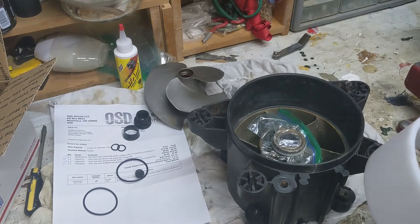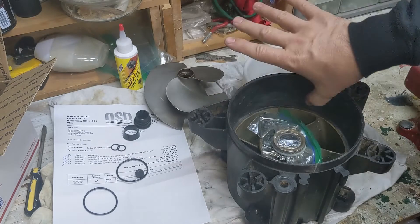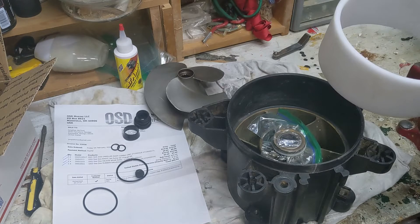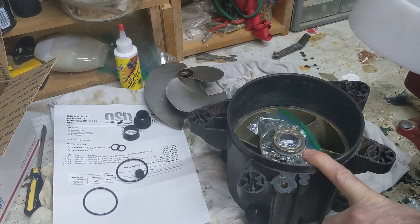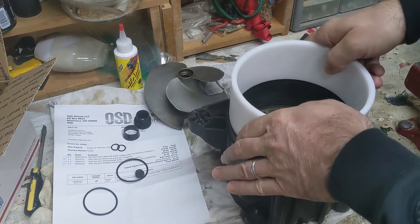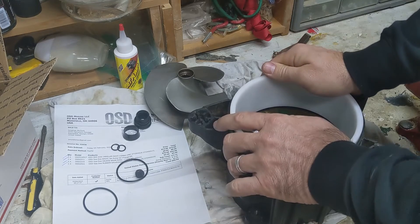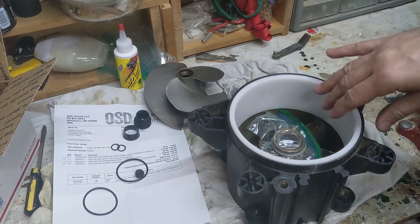Normally, if these fit tight, you want to make sure the inside of your pump housing is pretty clean and free of any chunks or glue. But if your wear ring does fit too tight, what you can do is let this sit out in the sun to warm up and put this in the freezer — this will shrink a little bit and this will expand, and then you can just slip it right in. But it turns out I didn't do either one of those things, and this actually fits pretty loose.